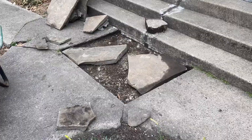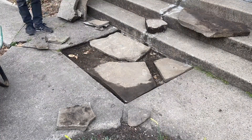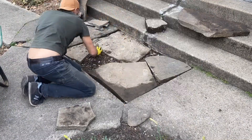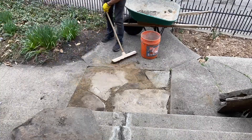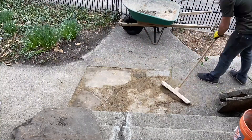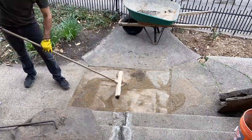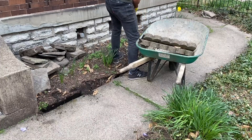Here I knocked out some really uneven concrete in the front entry and brought up these limestone pieces that I found in our backyard, just trying to rearrange them so they fit together like a mosaic, then started leveling those out and filling that in with sand. I put several buckets of sand on here and just broomed it in, poked it in, worked it in there, and then eventually the water also helped establish that a little bit more.